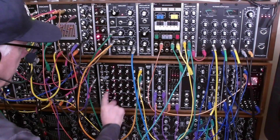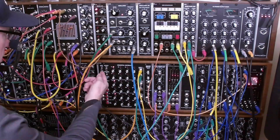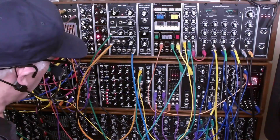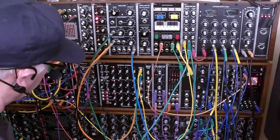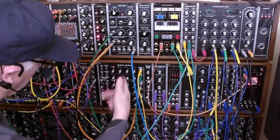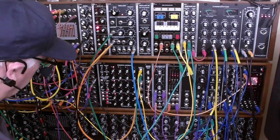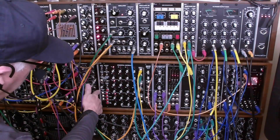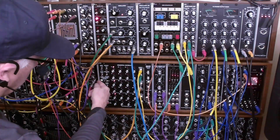It's a 3x8 sequencer. You can also change it to 1x24. The outputs can be plus and minus five or zero to five — that's the way I've got it set up — and it can cycle once or cycle repeatedly, sequence up and up or up and down. It's got a built-in clock, very handy, with two ranges. You can also go to an external clock.